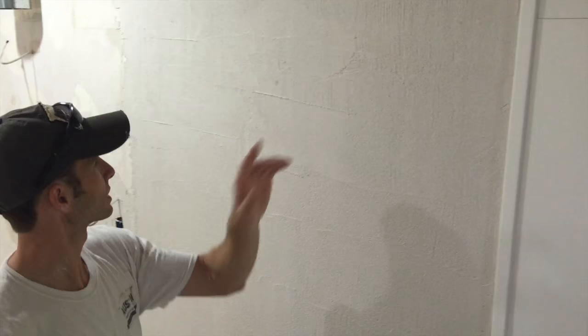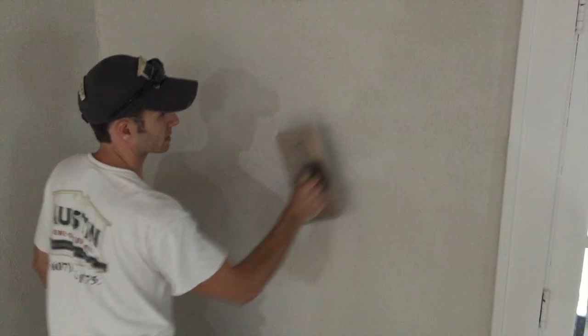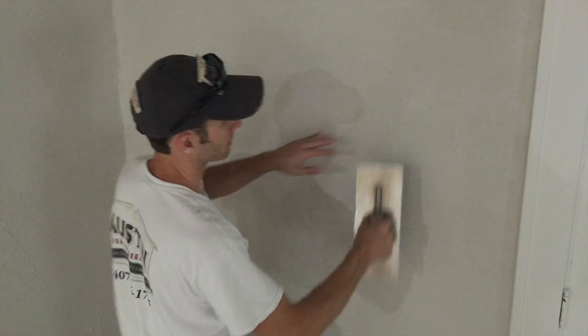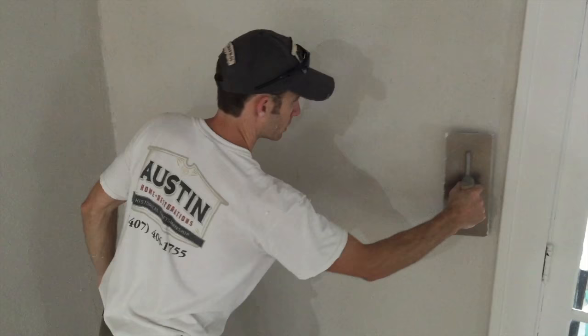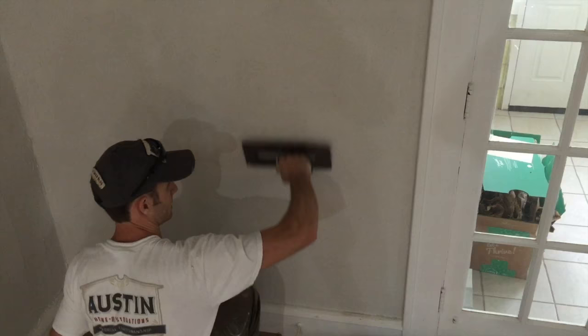It'll still feel damp, but you shouldn't be getting plaster on your fingers. Come over here — we just plastered this one. If I put my fingers on here, I've got plaster on all my fingers and left little fingerprints. It's not ready to knock down. This one is ready. Just come through and work in different directions — this is compacting the plaster, making for a harder, nicer finish. It's taking out all the high spots and low spots and leveling it up. You're going to get some plaster on your trowel — just little bits — that's fine. It's pulling them off the high spots and filling in the low spots. Just work the wall until you feel it's polished and smoothed up.